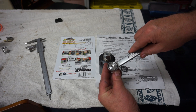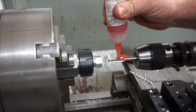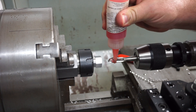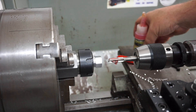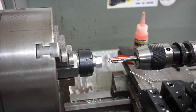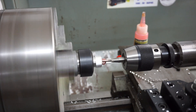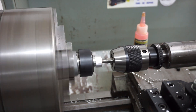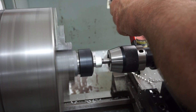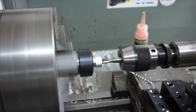Here's the original just to show you - the original was a little bit looser than mine. So back into the lathe, holding it by the hexagon collet block. A bit of Tap Magic cutting fluid - it's pretty good. Slow RPM and just let it feed the tailstock in under its own control, then wind it out. I had to hold the chuck on this otherwise it wants to undo the keyless chuck.